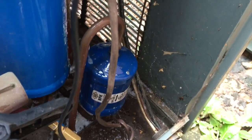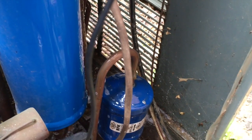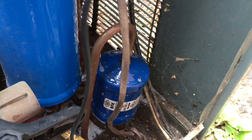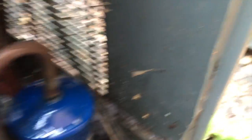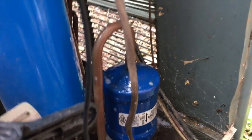All right guys, I found the leak — it's under here. I'm sure you guys can hear it. It's on the back side of that solder joint on that dryer. I can't actually pinpoint it but I can feel it. I'm waiting to get in touch with the customer to see if he wants to make the repair and load this thing up with R22 — we don't use retrofits here — or if he wants to look at a system replacement. If he decides to repair it, I'm just going to cut this dryer out, put a piece of copper right there, and install the new dryer outside the cabinet.